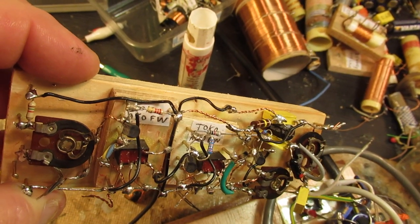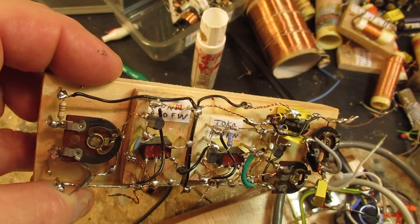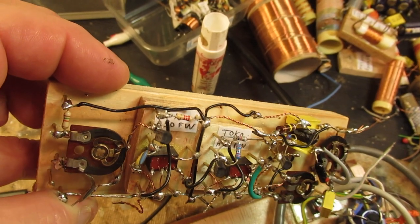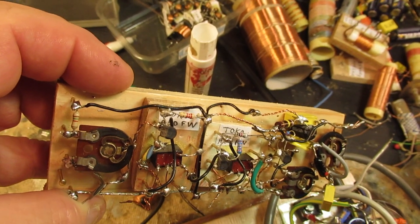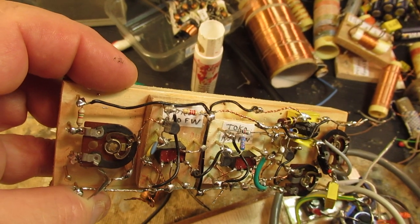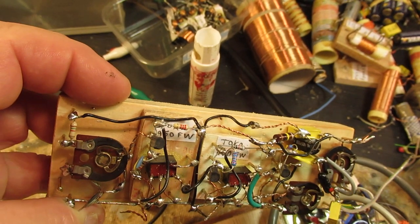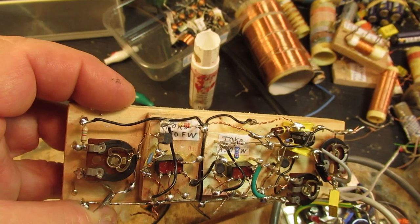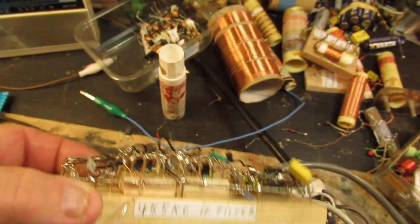And at first, one of these deeper problems is perhaps, I don't know that exactly, that perhaps the superheterodyne principle does not work so well. There could be all kinds of reasons, say, for instance, to get the right frequency transformation, perhaps 455 kilocycles is not far away from the frequency that you want to receive, but of course it must be possible.